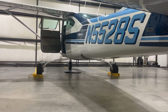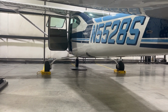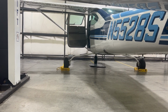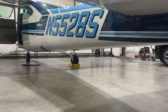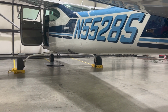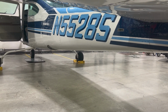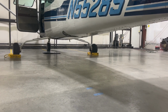The questions I asked were of the character, do you see anything here that doesn't make as much sense to you as it does to me? Right. Or do you see something that would be not in compliance with federal aviation regulations? And that's one thing that I found to be well documented in Dynon's instructions, was they tell you the field of view, the number of degrees of angle that you can put instruments in, and so forth. And so that's an example of the number of different constraints that you want to make sure you pay attention to. Great. Well, let's talk a little bit more about that panel. Let's get some shots in there.